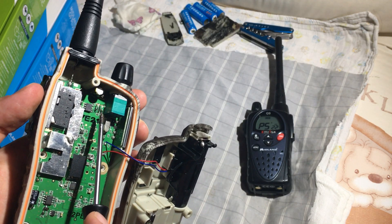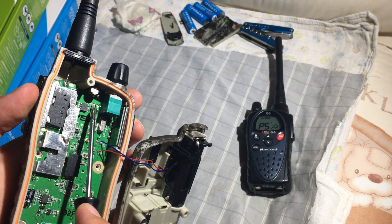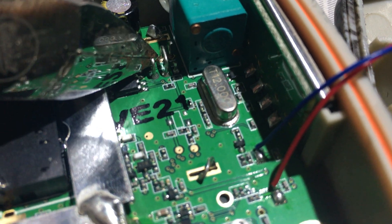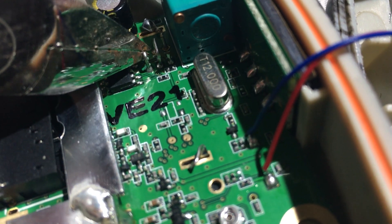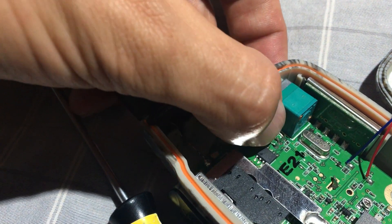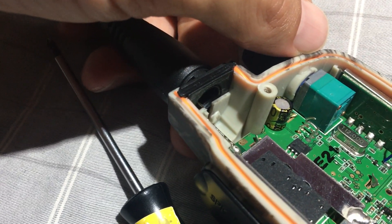Right here are the 3 connectors: J1, J2, and J3. We're going to close J1 and we're going to open J3. So we cut J3. Once it's cut, just put your fingernail on there and pry it back so they'll have no chance of connecting again.